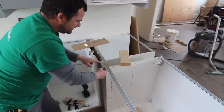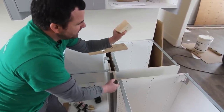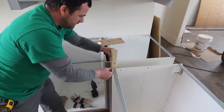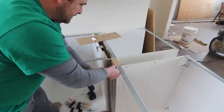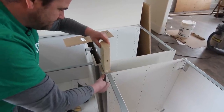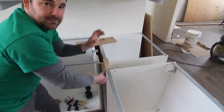One important thing is making sure this panel has backing. If I just rely on brad nails and somebody hits it hard enough, it'll pop in and it's too hard to fix later. So I've put a dado — a notch — in a two-by-four just to go around this funky corner for backing. After I brad nail the panel on, I'll slide this two-by-four in. The measurements are very snug. I'll nail this onto the panel, then install the two-by-four, slide it all in, and screw it tight from the cabinet to grip everything together.